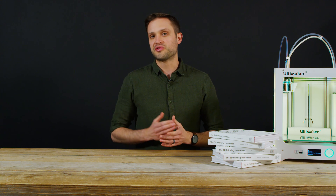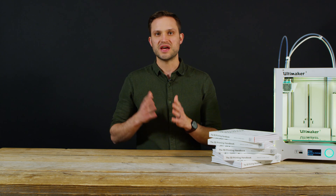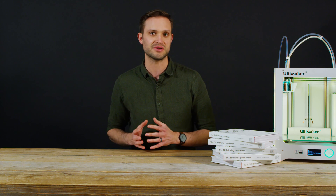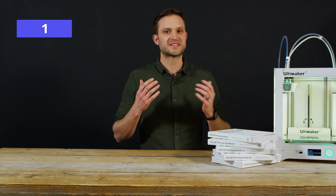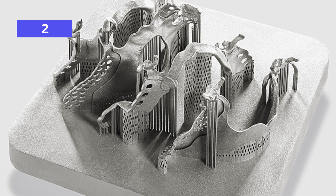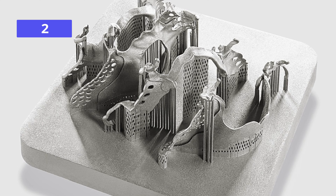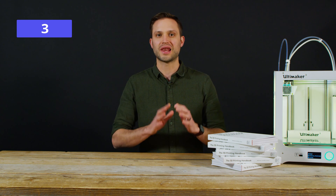When it comes time to start designing your parts, there are a few things to keep in mind. Metal 3D printing is the most difficult 3D printing technology to design parts for. Just like CNC has undercuts and injection molding has draft angles, there are a set of rules that must be followed to ensure your parts print accurately and successfully. Support structures in metal 3D printing serve three different functions: they offer a platform for new layers to be built upon similar to FDM and SLA; because of the temperatures involved, metal 3D printing is particularly prone to distortion and warping, so supports anchor parts to the build plate to help combat warping; and they act as a heat sink, drawing heat away from the part and allowing it to cool more uniformly.